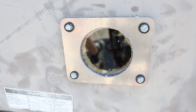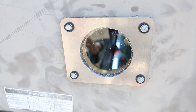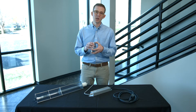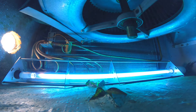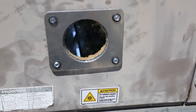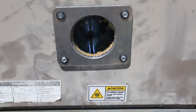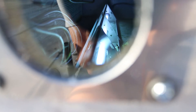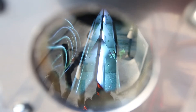Another safety consideration we used is a sight glass on one of the panels. A UV sight glass incorporates UVC-blocking plexiglass and gives us visibility inside the cabinet of the rooftop unit. This is important because we're able to see that the lamp is operational without being exposed to any UVC energy, and it also indicates to anyone maintaining the rooftop unit that a UV system is installed and that they need to exercise caution.